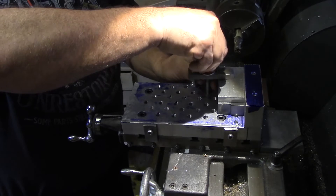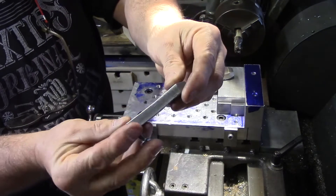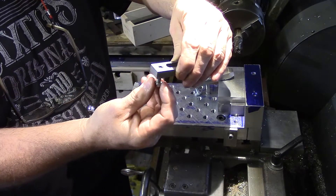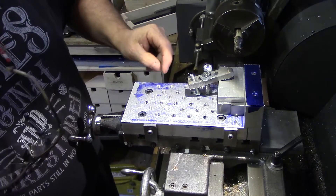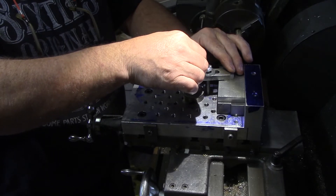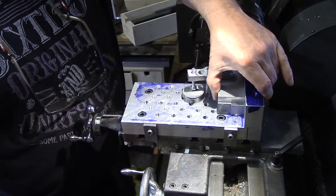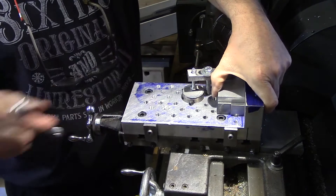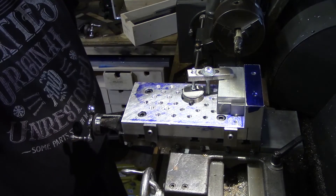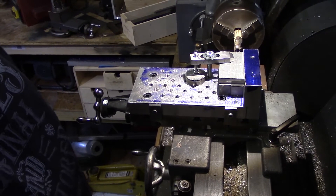In this instance the clamp goes on there — I made these clamps from mild steel, you can buy them obviously, with a slot milled out the back and an M6 tapped hole so you can put a bolt in. I'll show you: you use that M6 screw as your packing piece, so you want to lift it just slightly higher than the workpiece so the clamping force is down onto the workpiece. Just pinch that up, hold it nice and square against the back, and that'll hold it perfectly securely while we do a run across on the mill.